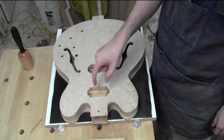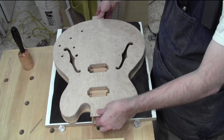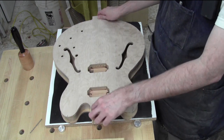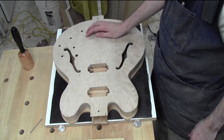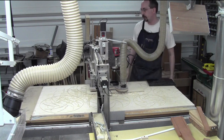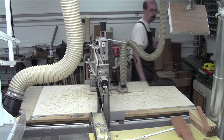That lets me basically go and make another template that is the 2 holes with a pocket hole that's a mortise hole 1/8 of an inch larger, and I can use the same 1/2 inch plunge bit, 1/2 inch router bit, and collar. Yeah, we're ready to cut the routing template for the neck mortise now. So we'll grab some hearing protection and begin routing.